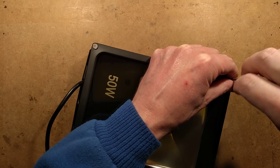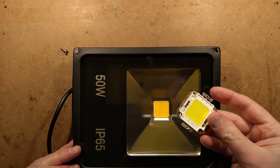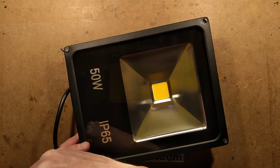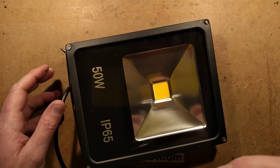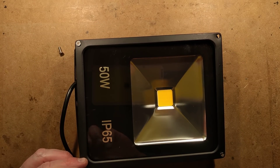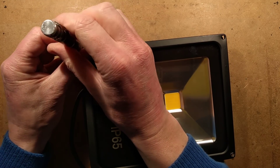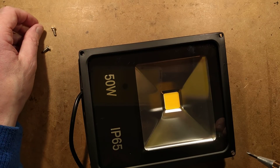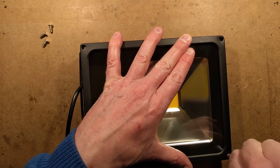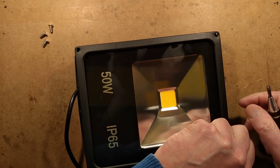I have ordered some replacement LEDs for it — the flip chip style but the newer version that has inverted chips with no bond wires. I think they're going to be more reliable, but the only way to find out is to try them. My lights up there are two 20 watt lights flooding down onto the workbench with a bit of diffusion. They have 20 watt drivers and I used 100 watt LEDs purely because it spreads the dissipation. But I had major problems over time with sections of the LEDs going out, then flashing and strobing. It seems to be the main issue with that style of LED — the gold bond wires have problems where they connect onto the bus bars at the end.